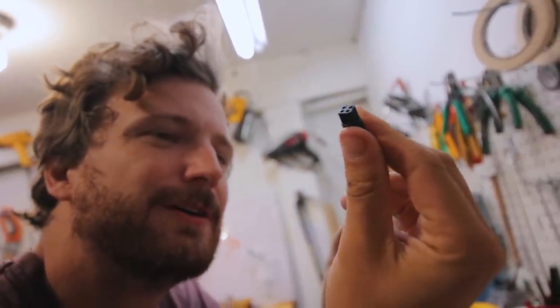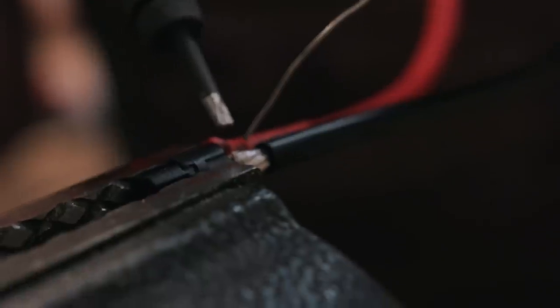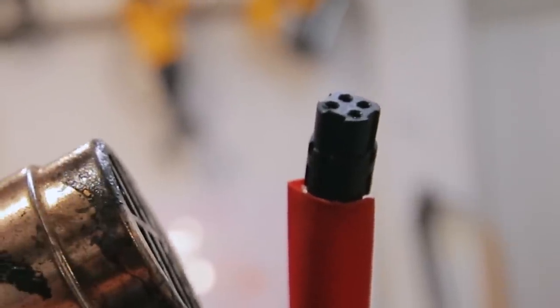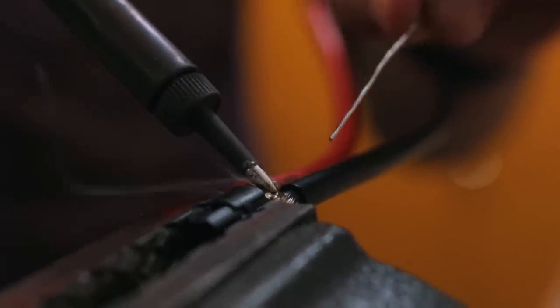Such as here's the plug that I've been looking for a long time. Finally found it. Cost like 10 bucks just to order this one. The bottom's positive, the top is negative. What color is positive? Red. And it's split across two pins because the power draw from the laptop's so big they need to get a 4-pin connector and just have two of the pins be the same thing for each half of it.